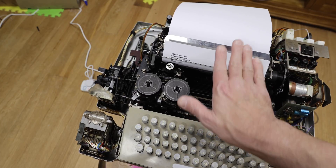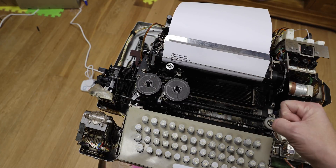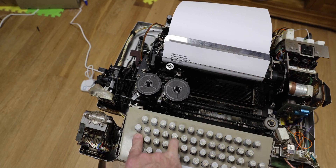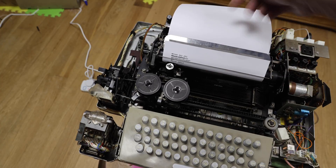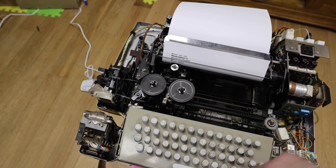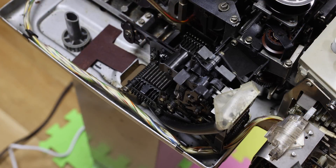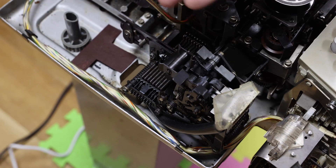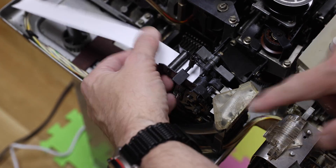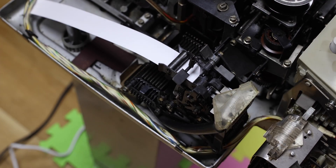There are also bars that go under the eight bars which catch with a particular pattern, a bit like the keyboard — they're function bars. There's one that catches at just the right combination for a bell and causes a bell at the back to ding. There's one for carriage return and one for line feed. The paper tape punch has rods that stick out and operate the punch based on the eight bits that are fed. There's a release, a back step, and an on/off switch.